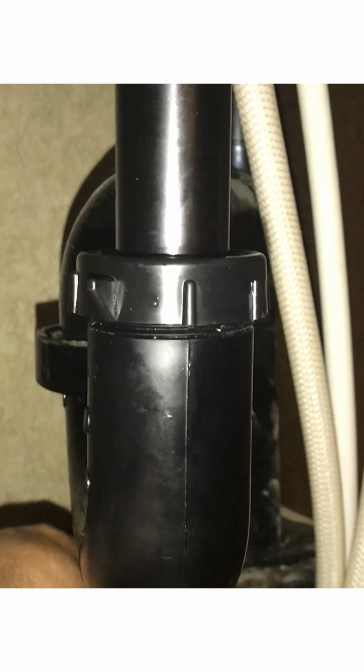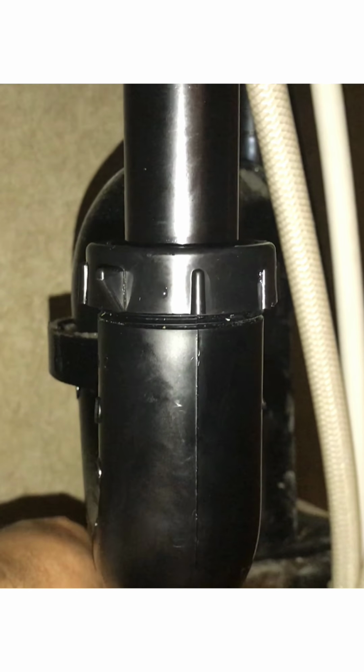So right down here, I pulled that grommet up and cut the wood, made a little half a rectangle, if you will, coming forward so that I could lean that forward just enough to connect all of this. And so far, everything seems to be working just fine. So if your plumbing doesn't line up, you can cut through this board here down where the main drainage goes to your tanks and make it all work.